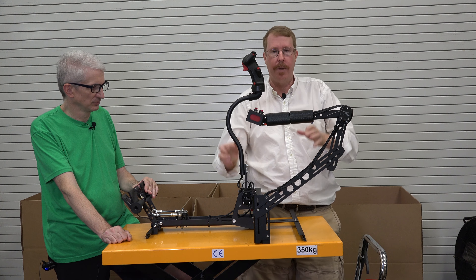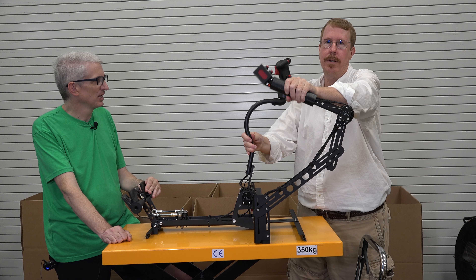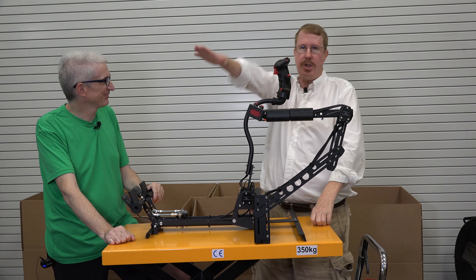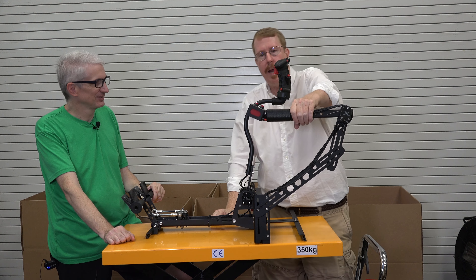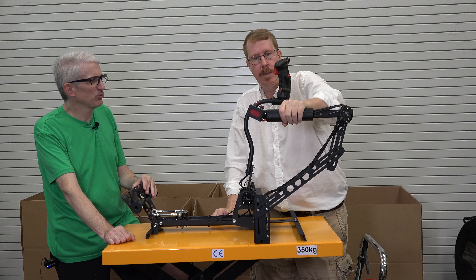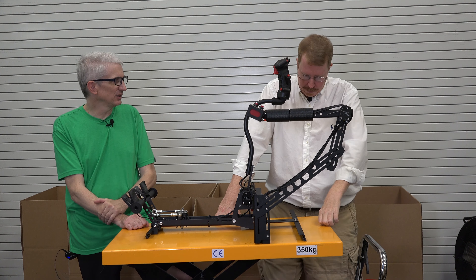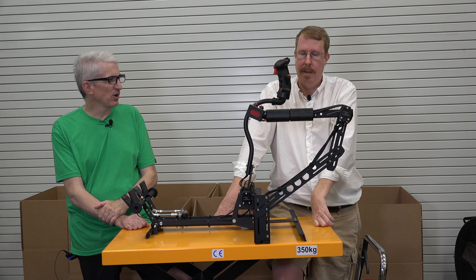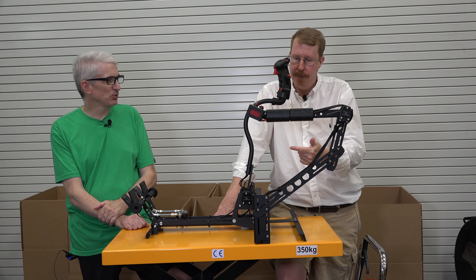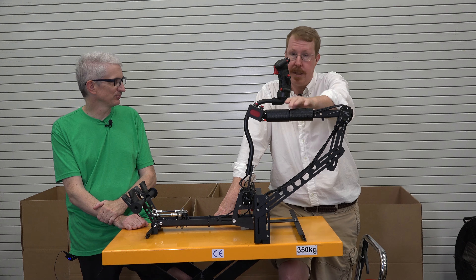And what's this called? That is the collective. And why is it called the collective? Because it changes the pitch collectively — the whole rotor changes pitch no matter where it is in its rotation. And then what are these little motorcycle throttle handle-type things? Throttles — which aren't as relevant these days because you typically have an auto throttle, but you can use them to raise the throttle when sitting on the ground.